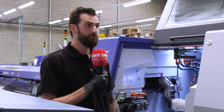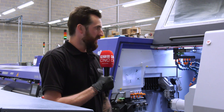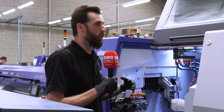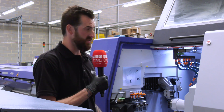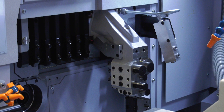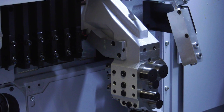It's a much heavier machine — do you assume from that you're going to be able to machine harder and faster? Yeah, that's probably one of the few things that we'd want more from this machine. It has got uprated spindles, uprated tooling on the sides, and the power tools on the side working are ER20 collet so you can fit bigger tools in there. It's going to be a real advantage to us when we're machining those bigger parts.